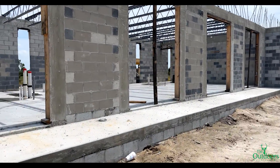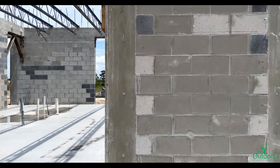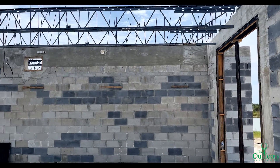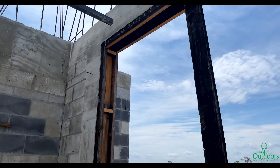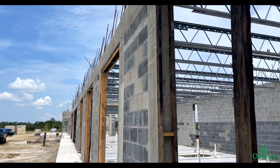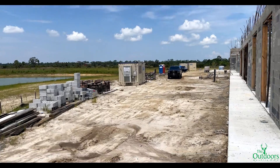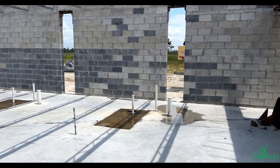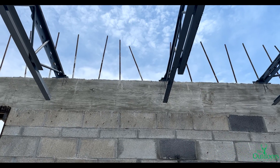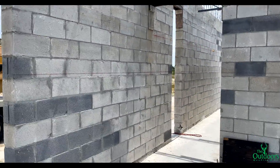We're just about almost done setting these metal joists. The crane had to back up a little and take a small break. As you can see, we've got everything basically all the way down to here. We only put about two metal joists over in the master bedroom still, and we have some rebar to cut — drill, epoxy, and put another one in so the joists fit perfectly. We still have to load up the half-inch plywood and put the telescopes inside as well. The guys already marked the telescope locations so we can just put them in and push the plywood up.